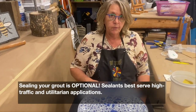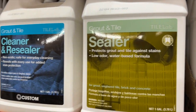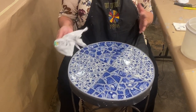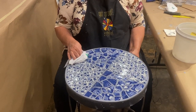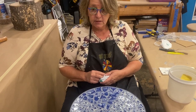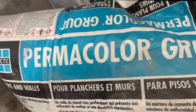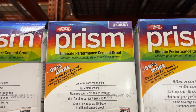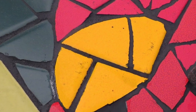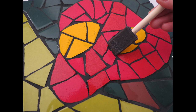A lot of people ask about sealing the grout. I'm not a big grout sealer. I feel like stains are harder to get out because they get stuck in the sealer rather than just the grout, and it's often just easier to clean. Also, you have to worry about food safety and other things depending on your situation. There are a lot of polymers and other additives in the grout these days, so I really don't feel like sealing is necessary. Check with your local tile store for your grout and sealant options — they will have the best variety. In North America, many grouts have sealants and UV protectants in them; they cost a bit more but may be worth the investment. Sealing your grout is labor intensive — you must remove any excess from the tile surface or a dull residue will occur. It may be easier to apply the sealant with a brush, painting it on the grout lines.